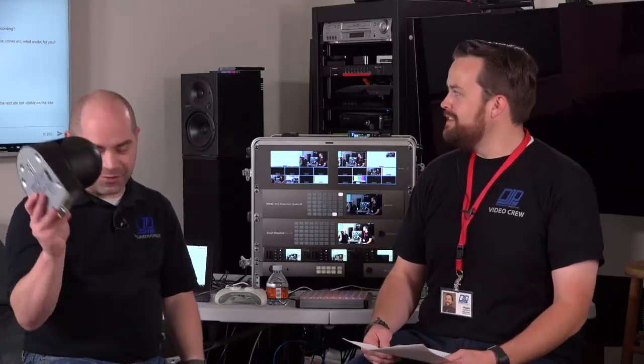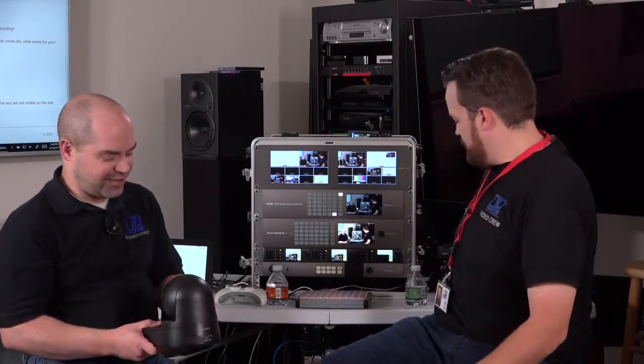I've always seen it work very well, and I guess this whole job is problem solving, right? Yeah, all the time. That's the constant nature of the beast. Replacing the circuit board solved the problem to a point. The one problem is Sony will not acknowledge that this is a problem. You can't change the IP address on the camera with a new board. The board shipped from the factory not fully programmed, and the IP address can't be changed. So I have to do all sorts of funky stuff in order to communicate with my camera number 2, because it's stuck on a single IP address that I can never change. Come on, camera makers. I hope Sony gets that fixed because it's a real problem.